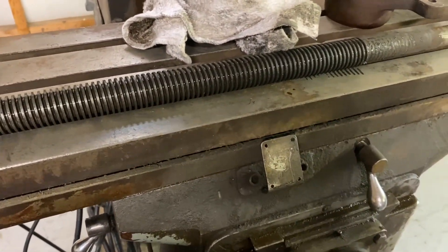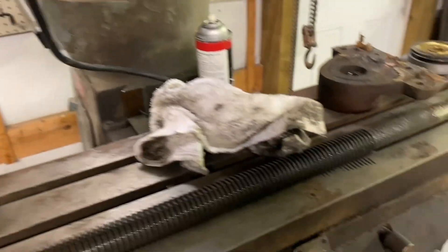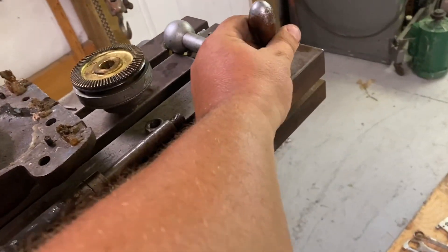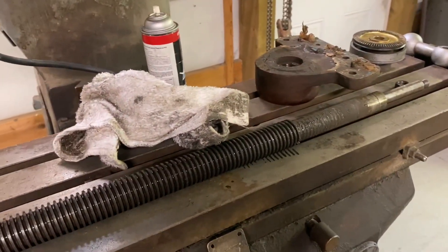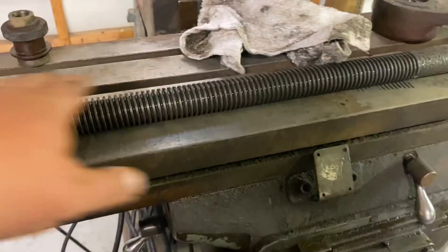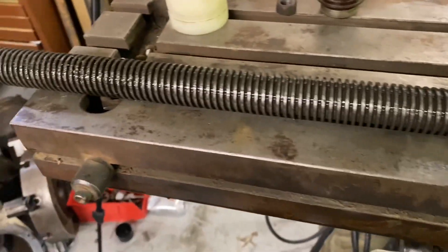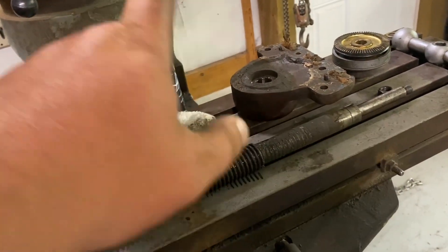What we'll do this weekend is get the XY vise on here, dial it in, get the head upright, and cut that keyway for this handle. I think that'll work plenty good for what we're doing. Obviously the best way would be to clamp it on the table in the T-slot. The way the handle was on there, I don't want to use a horizontal cutter and have a lot of lead-in — the radius, as it were. So I'll just put an end mill on this and call it good.